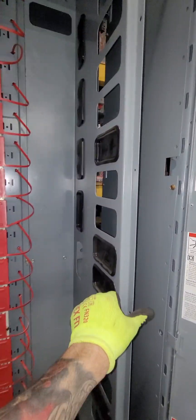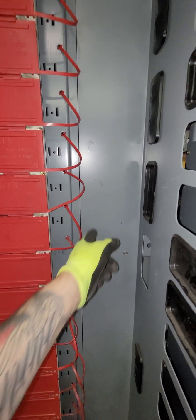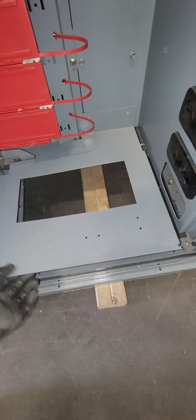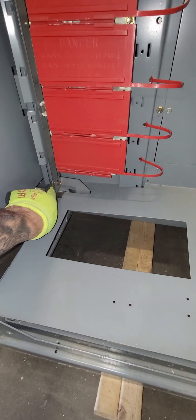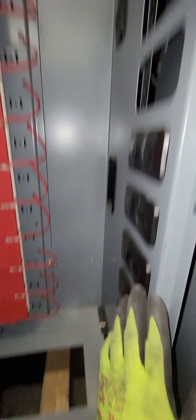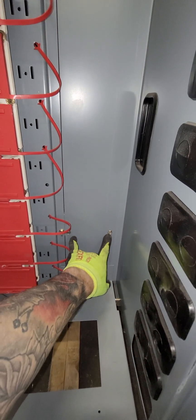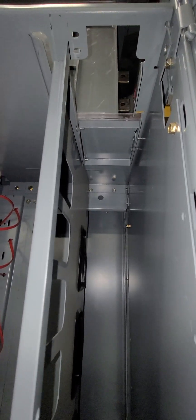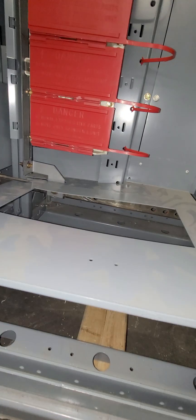The next step was this large L bracket — all one piece of sheet metal. It comes down here and ends right here. This big L bracket also has a bottom divider pan or isolation barrier riveted to it, so that will stay with it. We slid the large bracket in and connected it through two screws here, two screws at the top, and two screws down there. Everything basically screws into those horizontal cross members — that's a reoccurring pattern. Those are your main structural supports, and this bracket is no different as it screws into those three brackets.